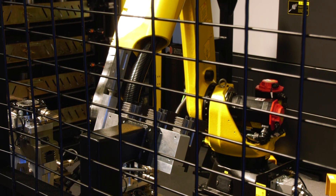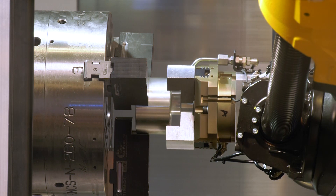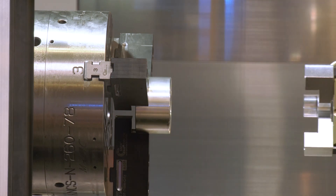There's always the argument that volumes aren't sufficient for automation. But that's exactly the purpose of what's being shown here — smaller volumes, larger diameters, longer components, and flexibility. You can have a different set of components in each drawer, so you don't need large batch sizes; smaller batches can be programmed alongside separate parts on the shaft stocker.